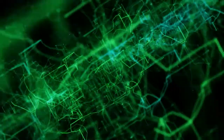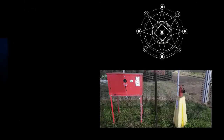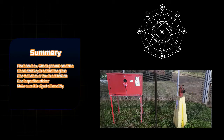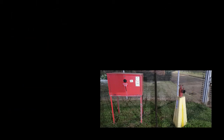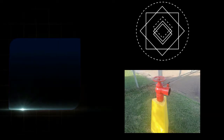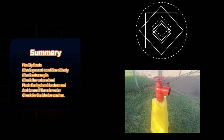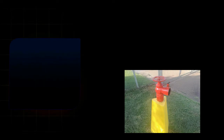Quick summary: Fire hose box — check general condition, check that the key is behind the glass, see that the glass or box is not broken, and make sure the inspection sticker is signed off monthly. Fire hose reel — check general condition, check hose and nozzle for damage, check nozzle is sealed, check service date on sticker, signed off monthly. Fire hydrants — check general condition, check release pin, check valve wheel, flush the hydrant to clean out and confirm water, and check for the Morris washer.